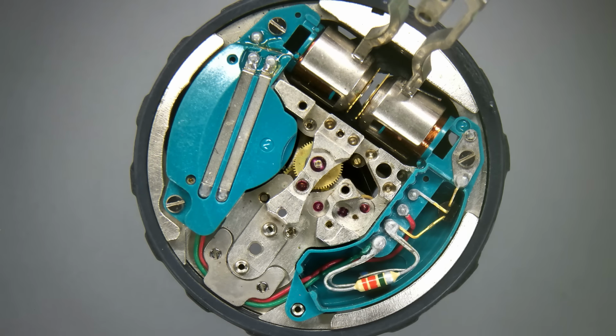But yeah, you can see what I'm looking at and what I'm trying to get to is to inspect all of those teeth. Washing-wise, it's not going to go in the cleaning machine. It's a bit too risky. It'll go in some watch cleaning fluids and then some rinse fluids in the ultrasonic. I'll probably start it first on a type of solvent called Renata, an English thing. It's a hairspring degreaser, really. And they're just so fragile, so expensive, so small. It's got everything against it. And if I can still use this wheel, then that's triumphant.